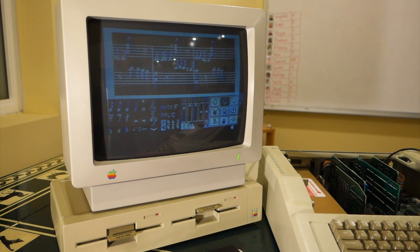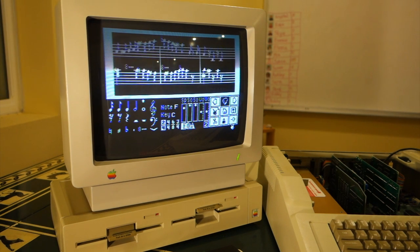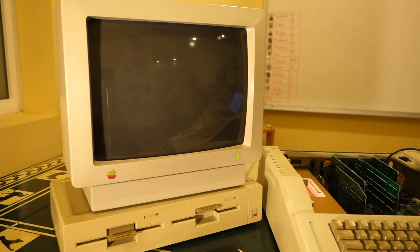The one bug I was mentioning: the left and right channels are actually reversed. This is due to a mistake from about 10 years ago where somebody cloning the Mockingboard reversed the left and right channels, and that mistake has just been copied in all the clones since then. It's easy to fix if you want to do it yourself, and I'll show you how in the next video. The other problem is the input from the Apple II motherboard — it's a mono input, and it actually muddies the two channels, mixing them together so you don't get nice clear channel separation. That's also an easy fix I can demonstrate in the next episode.